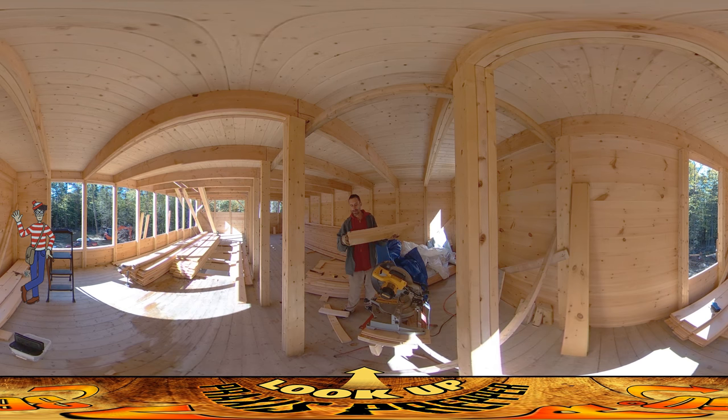What I've created are three boards exactly the same size with perfect 90-degree cuts. If you're going to do a job like this yourself and you're thinking about this versus a table saw or whatever, this is a pretty cool tool. I use a table saw for ripping boards down, but for doing carpentry like this you get a lot of use out of a chop saw. Seriously consider getting one if you're doing a whole-house build, or just rent one — they're really worth the expense because you get great cuts and it's a lot faster than using a carpenter's square.